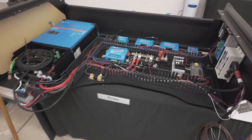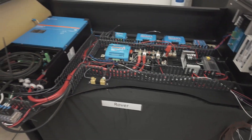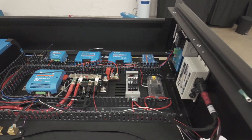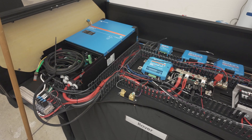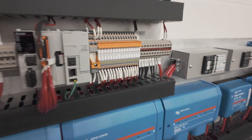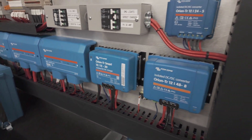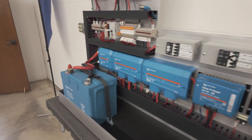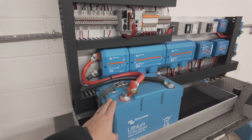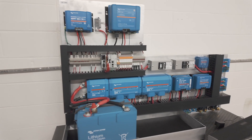On this side, we've got the same exact backplane because it's also going in a Rover bed Murphy system. This is for Rover vans, and this runs on a native 48-volt, not 12 or 24. So we've got different sizes for different applications, different kinds of batteries. And let me show you what one of these systems looks like when it's all dialed in. Look at this beauty — this is what it looks like when the pros do the job. Nice and clean. This is a 12-volt system, 330 amp-hour. So our system is going to have two of these.